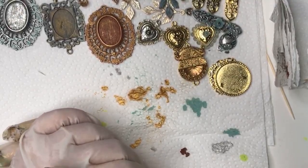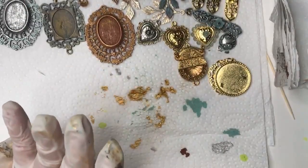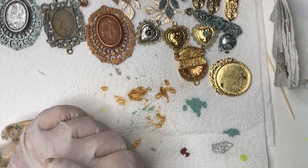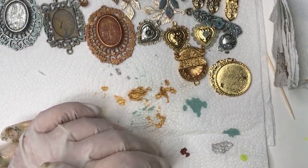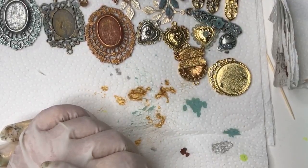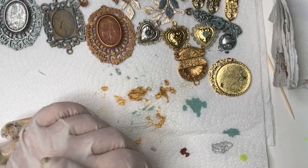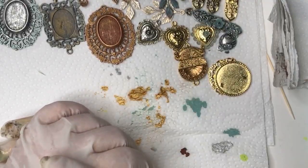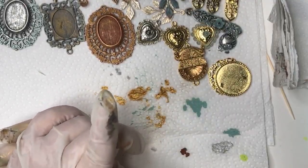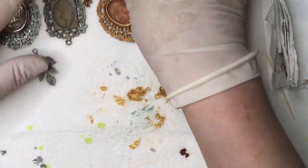In this case, of the pewter, there's no residue because it's all tumbled after they take it out of the molds. So it's basically a clean, soft, dry rag, and there's no machine oil on it. But if it's brass, like these pieces, oh yeah, you gotta degrease it.